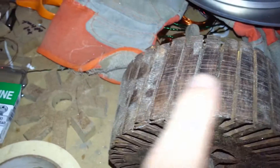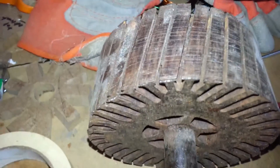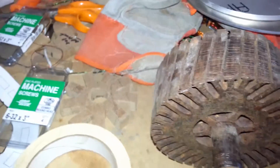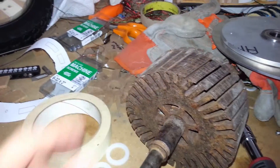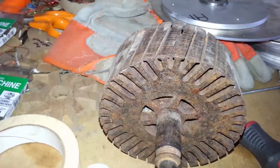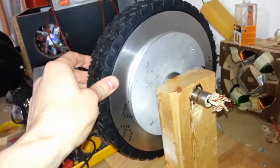This makes it much more smooth, because the magnet isn't attracted to any one particular tooth — it's got the same amount of metal under it the entire time. That's actually the best way to do it, but if you can get custom magnets built, that works fine too. It's a little more complicated, and I didn't bother because lining it up and cutting it properly is really difficult. And this doesn't have to operate at low speeds anyway, so it's not that big a deal.